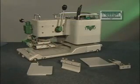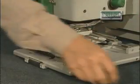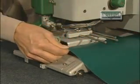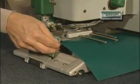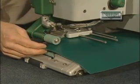The standard Triad Wedge Welder includes the three basic welding guides: overlap, hem, and fin, which mount in the rear of the machine next to the welding area. The overlap guide positions the lower sheet and is adjusted for the lower sheet of material to match the particular wedge size being used. This creates the overlap of material between the pressure rollers.